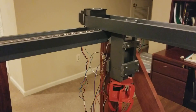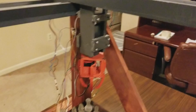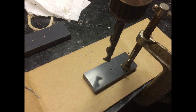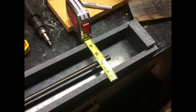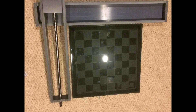The robot uses three linear actuators — X, Y, and Z — with a gripper at the end. The actuator channels are made out of PVC plastic and are held together with varying length, 1/8th inch diameter tap screws. The exact location of the tap screws is not very important as long as they do not interfere with the inside of the channel.